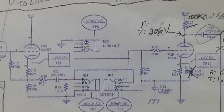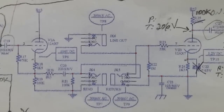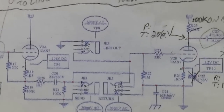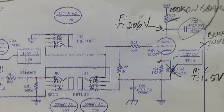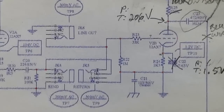I did this on another amp — an Epiphone Valve Special — where I pulled out the reverb and rewired it in parallel, and that worked amazingly well. But looking at the schematic, it says 300 millivolts AC at that effects loop input point. Because I rewired a lot of things and increased the gain, that signal went well above 300 millivolts. At some point with the ultra mode working — which pulls out the tone stack and removes all that loading on the preamp — the signal gets really high, well over 1.5 volts, which is the maximum input.